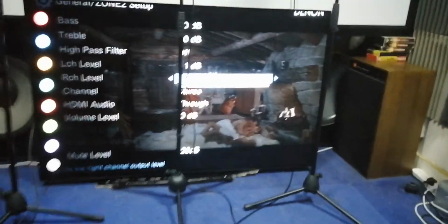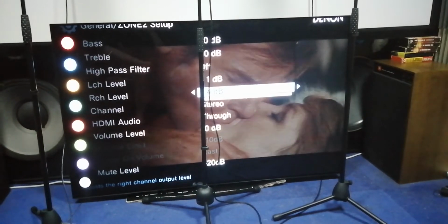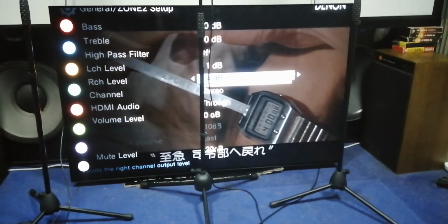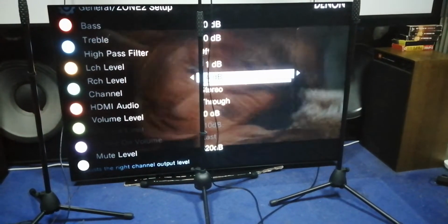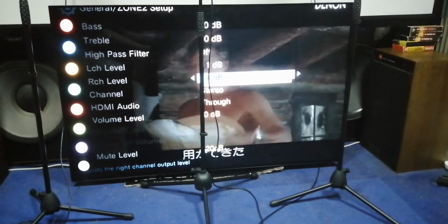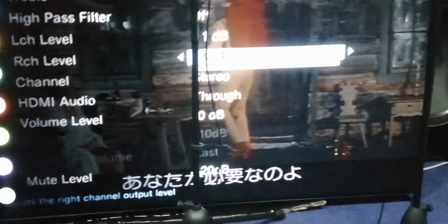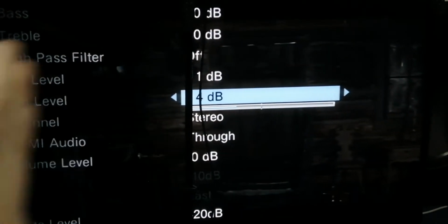Doing an alignment check because, you know, on our matrix decoder they need manual alignment, because they don't have what's called auto azimuth. Some things do, depending on what year, what grade, et cetera. So I've just had to do a slight manual adjustment of the left total, right total, so any common center dialogue will be in the center.